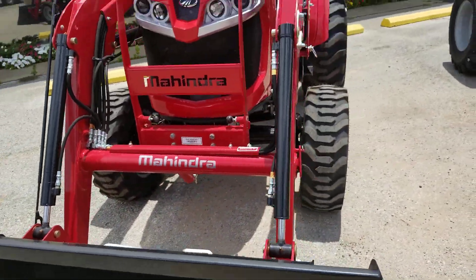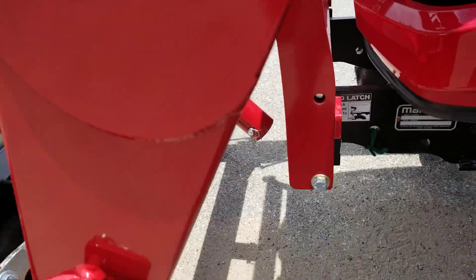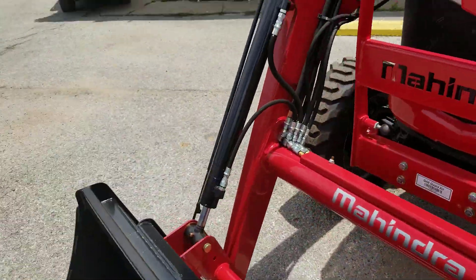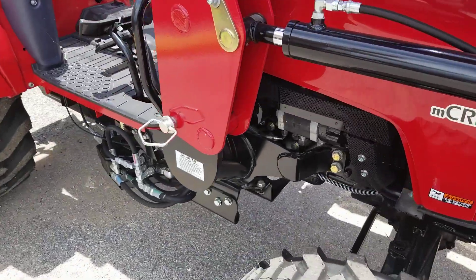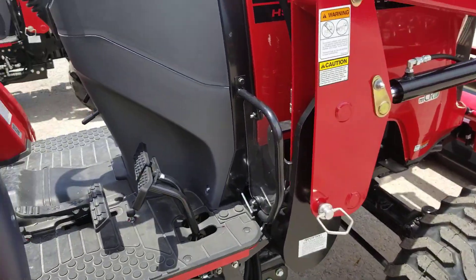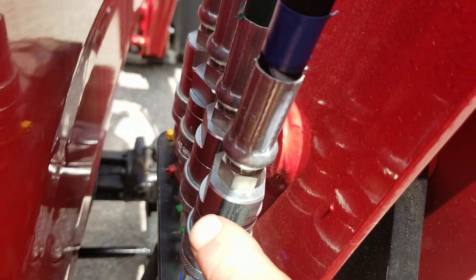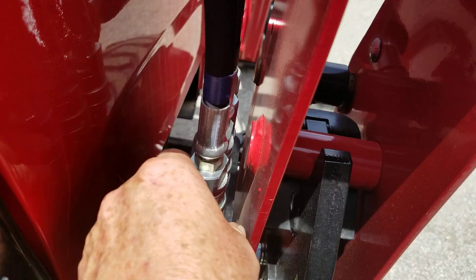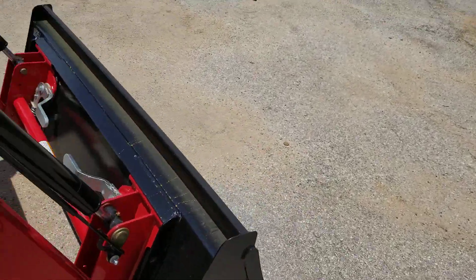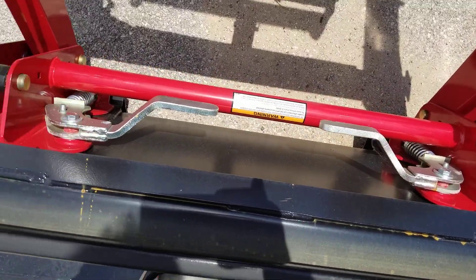The loader can be removed if needed while the loader is in the air. You'll see you have a kickstand right here — you'll pin it right in there while the loader is in the air. You have these pins you can take off because this is sitting in a cradle. After you pull these pins and back up off of it, cut your tractor off and then work the fluid out of the loader handle because there is pressure on your color-coded hydraulic lines here. So you can remove them and put them back on if you ever need to remove this. The buckets are skid steer attachment, just in case you want to put a spear, forks, grapple, or pallet forks up front.